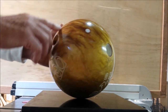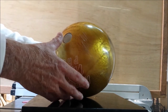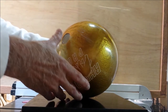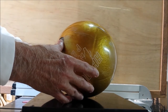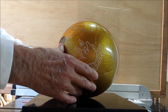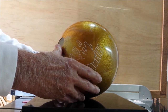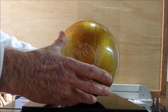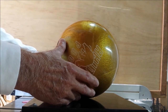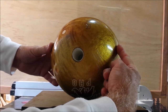Place the ball on the motion table in a position where maybe it's a good guess where the CG is. Put that on top. Release the ball and see if it rolls. If it rolls, pull the ball back to the release point and just slightly more in the opposite direction. Try to get that CG up on top. So pull it back farther than the original release position and keep doing that until finally, if you have a balanced table and you're very careful, you'll be able to get the CG directly on top of the ball. Almost had it. Try it one more time. Finally, we found the CG is on this location of the ball.